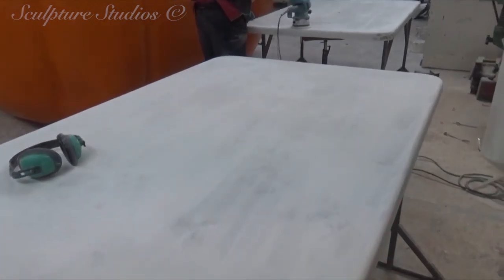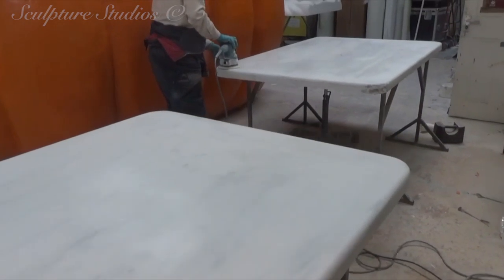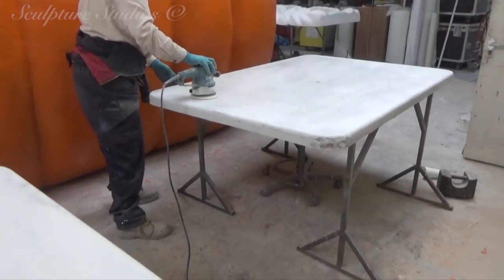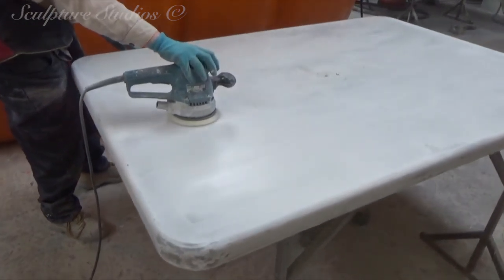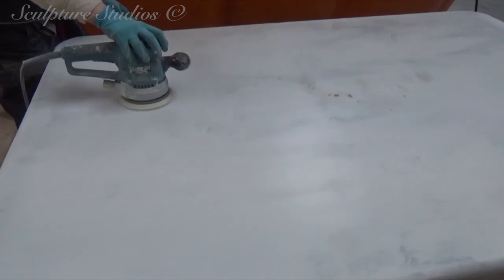We've gone into the mold with a release agent before applying a white gel coat layer. We've backed up the gel coat with glass fiber, extracted the fibreglass casts once the resin has cured, and trimmed off any excess material. We're just sanding down any imperfections in the surface, and if you're wondering why we haven't got footage of that, there's no time, we've got a deadline to meet. That's just my excuse for not getting the camera out.